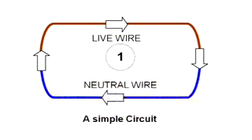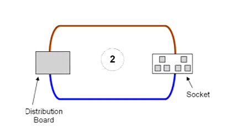So how does it work? Well, it works by detecting any leakage of current from the circuit in excess of 30 milliamps. That is less than 1/10 of what a 100 watt bulb would consume. It monitors the current flowing in both the live and neutral wires. The circuit supplying electricity to portable tools or appliances that are plugged into socket outlets should be protected by an RCD.